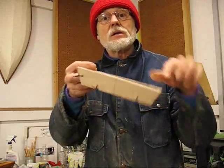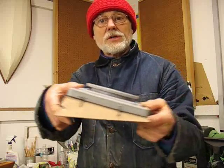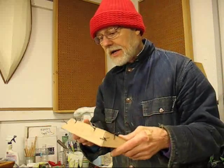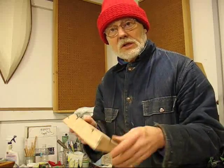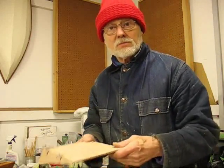Basically I've got my little platform and the seat will set on top of that, then screw down so I can move it front to rear of the boat. I'm going to mix up some Gel Magic just a little bit to jump stitch the inside — I can do that with a stick, no need to waste a nozzle. I'll do that tonight, then tomorrow come out and round it over, wet the edges, put on a layer of glass and wet that out. Trim it up the next day, then flip it over and do the inside with another layer of glass.